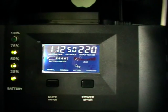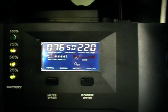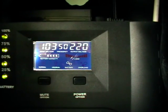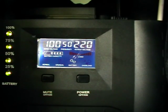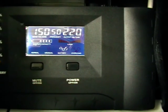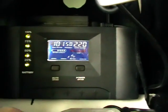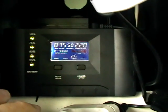There's a 120 watt solar panel on this roof with an MPPT controller. You can see that even on a really cloudy day it jumps around a lot — the volts coming in is jumping: 93, 90, 76, 95, 100. So that's what's coming in. You can see it's putting 220 out and the 50 in the middle is the frequency. It shows you the battery capacity — after running last night it's only gone down two notches — and a little symbol on the bottom and those volume scales are the loads.